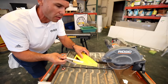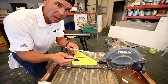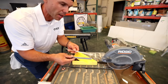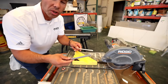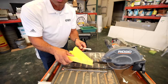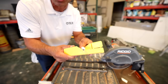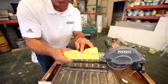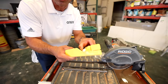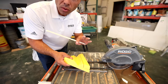Here's another feature that's really helpful — we also use ceramic Jolly trims a lot. These Jolly trims are usually about 5/8 by 12 inch and mostly go with ceramics. We use them a lot on backsplashes and also in showers. I'm going to show you both the outside corner and the inside corner. The square has a V-channel that allows the Jolly trim to fit in there and rest up against the angle to make the correct miter. It flips around so you can do both an inside and an outside.